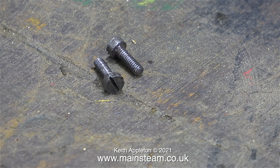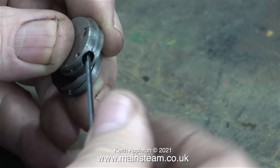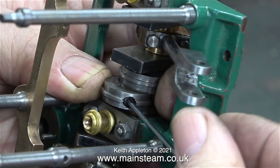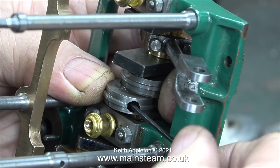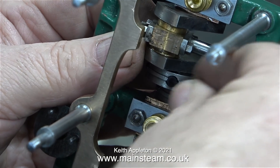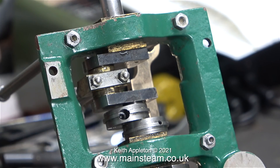Here are the two original slot headed machine screws, and I've shortened the Allen cap head bolts to be exactly the same length. Time to make sure everything fits — and it does. With both Allen cap head bolts fitted the gap is fully closed. Time to fit it on the crankshaft. The engineering needs to be quite good to make sure these two eccentric sheaves firmly clamp to the crankshaft; if they move at all the timing will be lost. I'm much happier using these Allen cap head bolts — the 7BA slot headed machine screws really were too weak. They're now fitted to the crankshaft and they're very tight. The only way these eccentric sheaves are going to move is if I slacken off the Allen bolts.